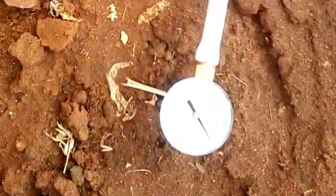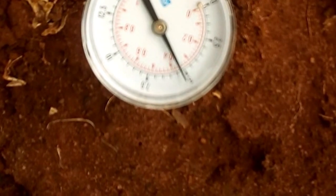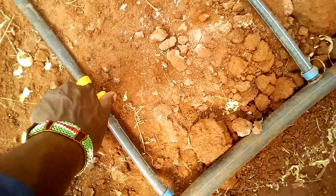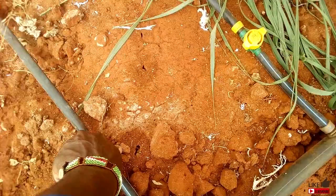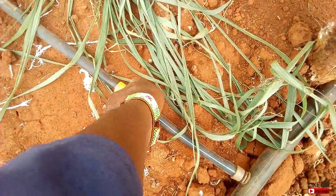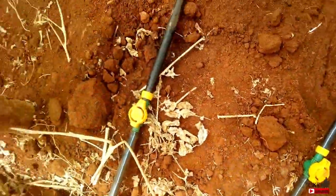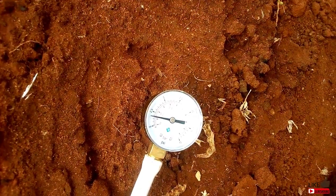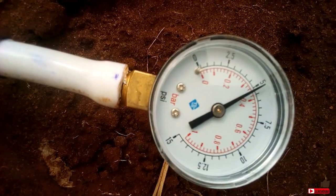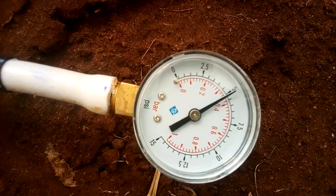The first order of business: let's see how much pressure is on the main line. It's somewhere around 5.3 PSI — that is the pressure with the pipe closed, no leakages or water flowing. Then let me open the mini valves to allow the water to flow into the drip lines on the beds. We should see some variation. Immediately after opening the drips, the pressure drops momentarily, and then after the drip lines are full and operating, the pressure stabilizes to about 5.1 PSI.